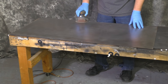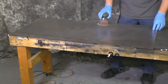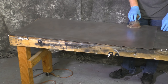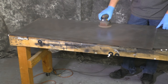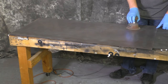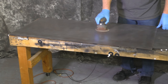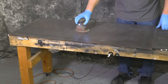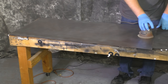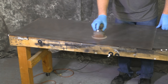As with all metal — and none more important than stainless steel — you have to clean it. Here we're going to use 80 grit on an orbital sander, though you could take it to the sandblaster. Whichever method you choose, you just need to get through that first layer of the stainless to get down to the portions of the steel that will react with the stainless black patina. Regardless of whether you sandblast or hand-sand, you do need to degrease it.